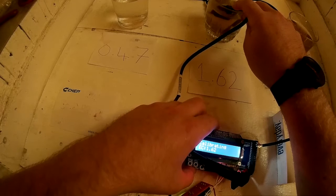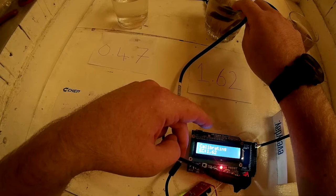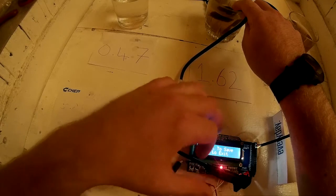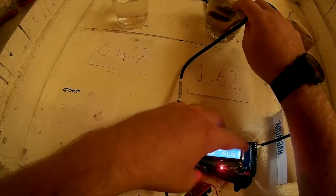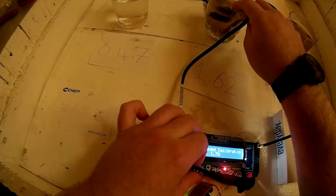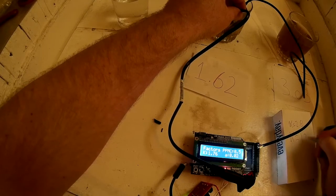It's saying it's calibrating — this will take 60 seconds. After calibration it's telling us good result. The new K value cell constant is 1.76, because it's a completely different probe. We press Select to save. It's saved the calibration as 1.76. So let's note that down: new K equals 1.76.